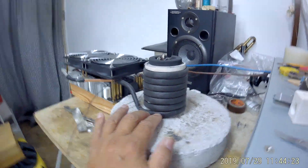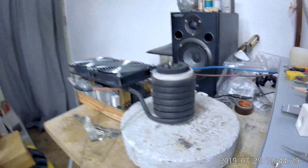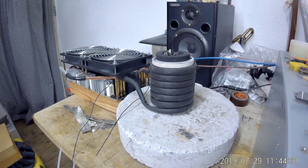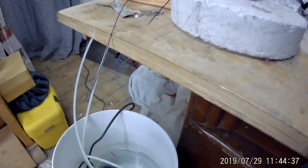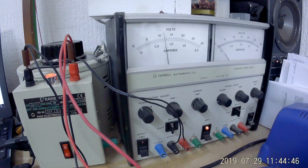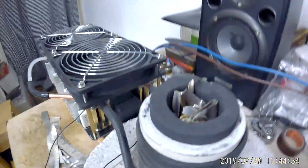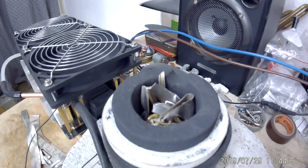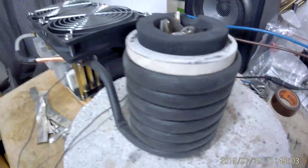We started off at 9, then we went down to 7, and I think we're down to six coils now. I've got everything set up, the water running, the fans running, everything powered — fans powered from my desktop power supply. All we need to do is turn it on. I've got a pot full of scraps over here and I'm going to see just how long it takes to melt that on six coils.